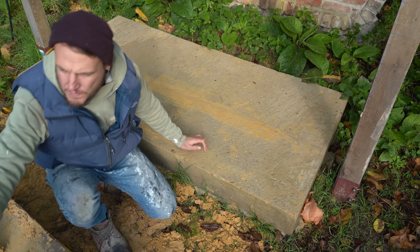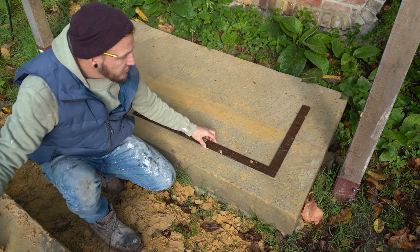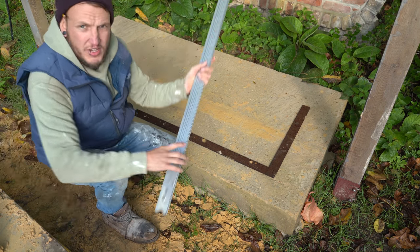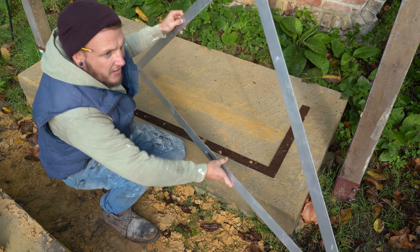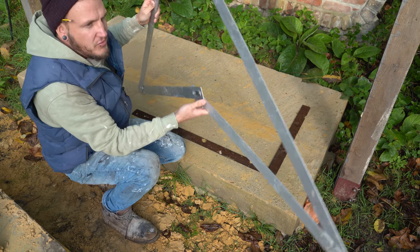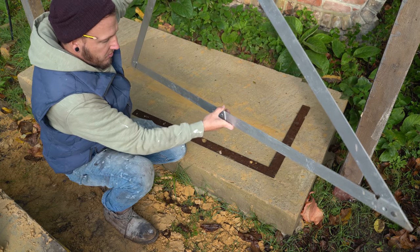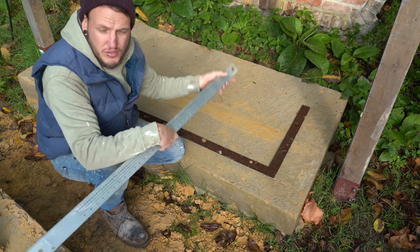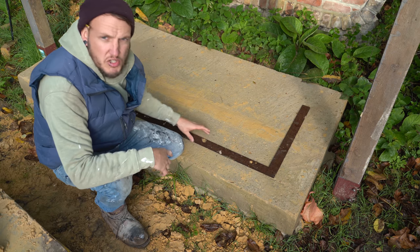A few tools you'll need - I'll link them all in the description as usual. I'm going to be using a trowel, a four-foot level, a two-foot level, and the boat level. Those are the basics in pretty much every video. Because we're doing a corner we want a nice 90-degree angle, so I'm also going to be using a framing square. You can also use folding squares - they're very easy to carry around. These framing squares I prefer just slightly. With the folding ones there's one or two mil of wobble where they join, but honestly that makes absolutely no difference when you're doing brickwork.